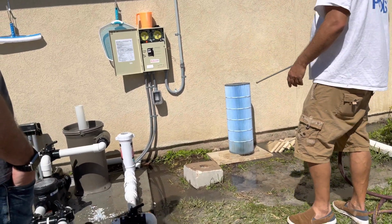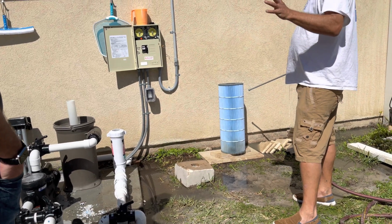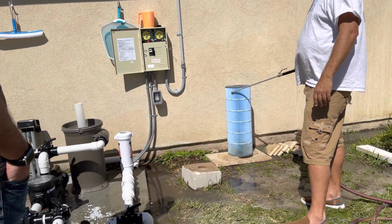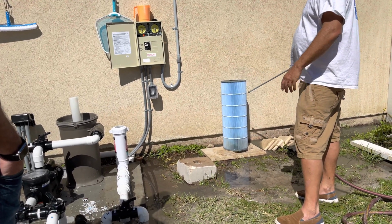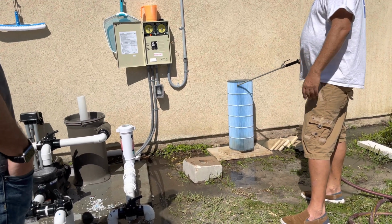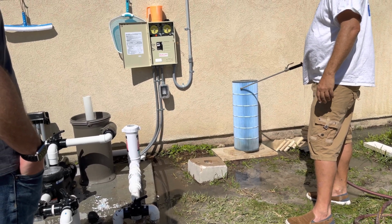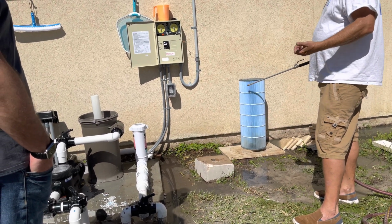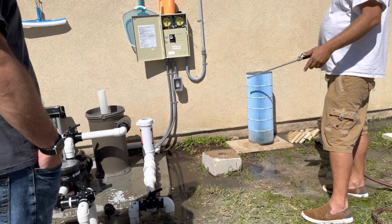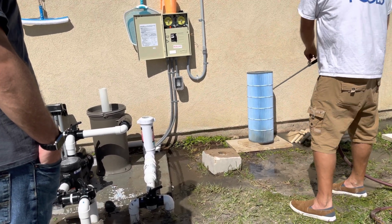What makes it smart? That blue coating is a copper oxide type of chemical. Microban 25, you've heard of that stuff? Well, they put them on filters now. So they laid out the polyester fiber cloth, and it's white, and then they spray it with this kind of chemical coating that turns it blue, because copper turns blue when it hits oxygen. So when water's passing through this filter, it's actually being treated. It's actually helping to soften algae and bacteria and kill algae and bacteria, which is what they call a chlorine reducing device, and that does the same thing. So that's the Microban coating.